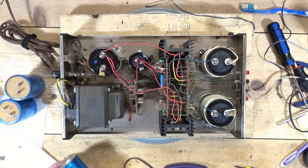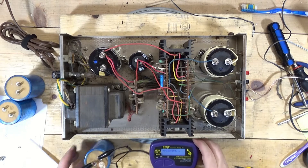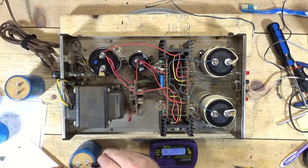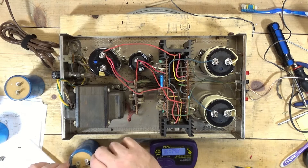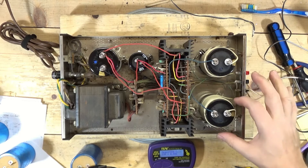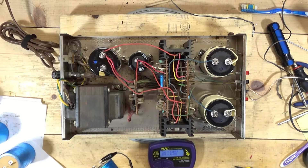So 1,160 — that's not horrible. This is a 5,000 microfarad cap reading 55, then 52. These two were also 5,000, and they're reading 55 and 72. This one was off a little bit — reading 63. And this one was also a 5,000 microfarad cap.